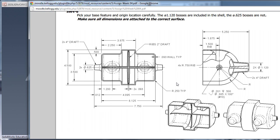There's two of them. So give this one a try, it's kind of fun. And again, be careful about dimension location. Do not dimension off of this edge when you've spun it around or something. Make sure all your dimensions are always sourcing off of this edge. This is the datum, if you will, or baseline for all the left to right dimensions. No matter where they go, this way or that way, everything is measured off of this side, okay?